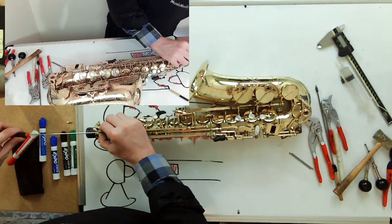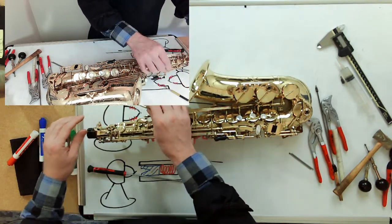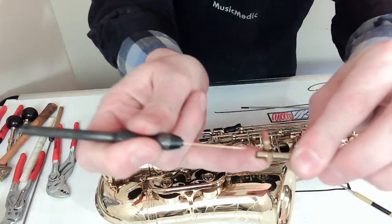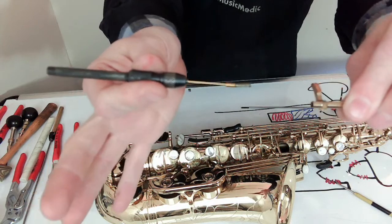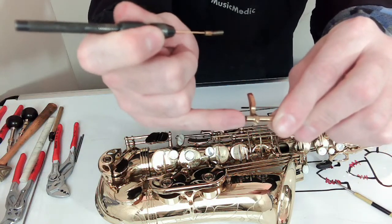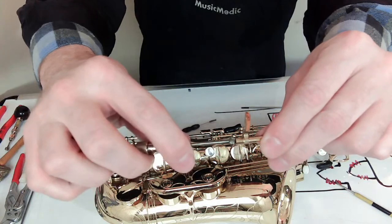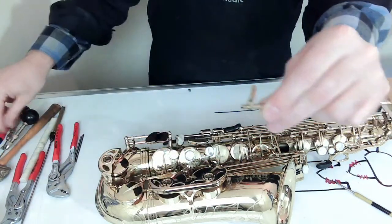Let's say you can't move the post for whatever reason — we're going to treat it the way I would normally treat it. I'm going to take off the key. Now with my extra fancy tool: all I need to do is take that bent end, stick it right in that bushing, and — there it is, like magic — it popped out just like that. Sometimes these are tough to get out. What may have happened at the factory is there's a little inner or outer burr that folds in and prevents it from coming out. You can take your ball burr while the bushing is still in and just remove that burr, then try again — a lot of times it'll pop right out.